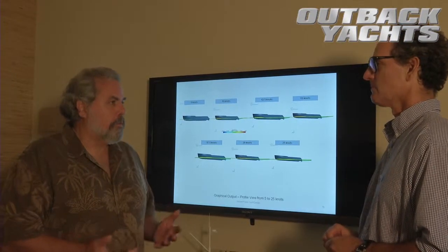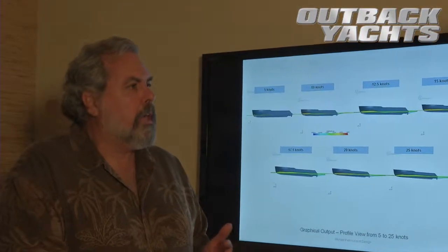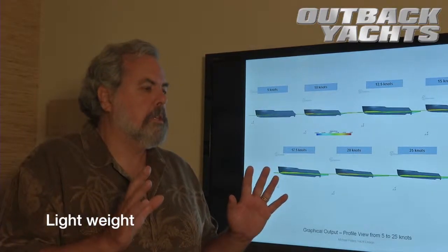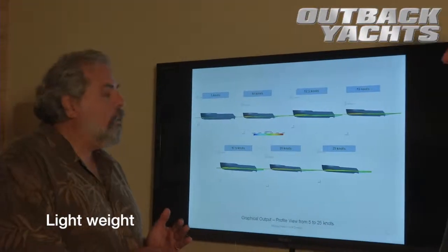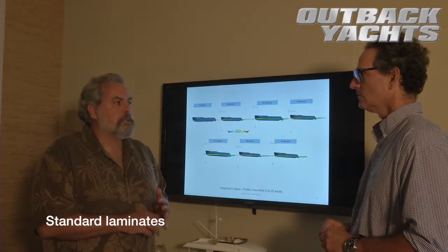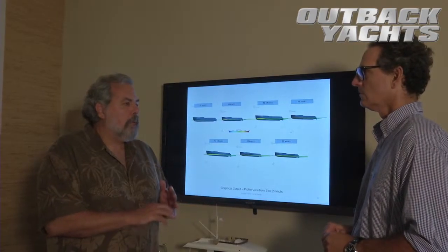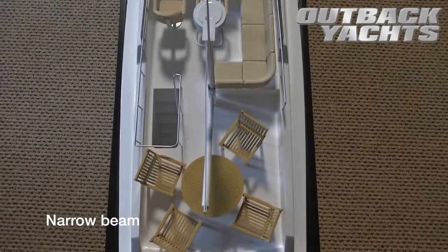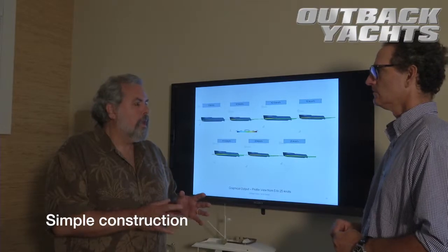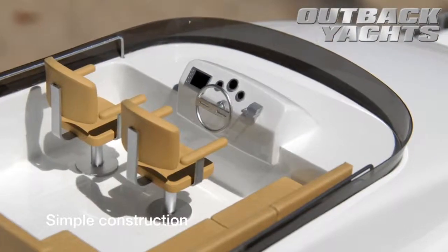So the challenge was actually getting all three of them to work together. They're all hooked together because in order to get the boat to be efficient, we have to make it light. But light usually raises all the antennas about high cost. The way we achieved it with this boat was by using standard laminates, not high-tech composites, that would have absolutely killed the cost. We kept it light by keeping the boat narrow beam, simple construction, and keeping the mechanical parts simple. If you do this reverse snowball, you can get the weight out by simply not making the boat overly complex.